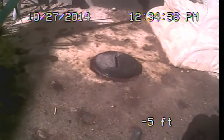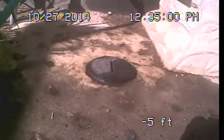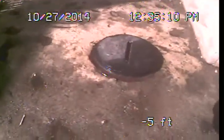So I am going to be performing today's examination from our 4-inch main sewer line cleanout located here out in front of the structure. And this is right next to the main water supply to the left from our front porch entrance here. Look down, you'll see this black plastic cap sticking up. Drop in. This is going to push us basically out to the public sewer here under the street. Get a little water going here to clean the camera off real quick.